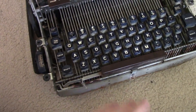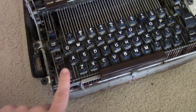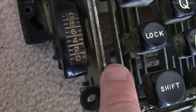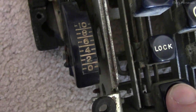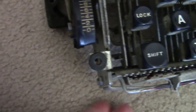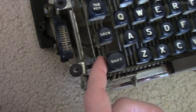As for the state of things: all the keys work, though some don't make it all the way to the page - I think lubrication will fix that. The R key has the repetitive triggering problem which I believe I can fix with the adjustment screw. The reason the shift keys were stuck down is because the shift lock was stuck. The shift lock has a little catch that sticks under a bar, and when you press shift a spring is supposed to move it free - but that doesn't work, so I have to manually reach underneath and unhook it.